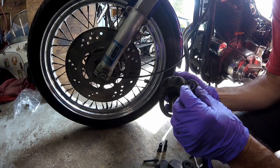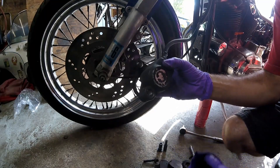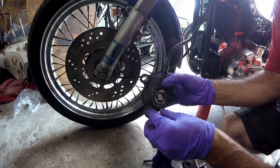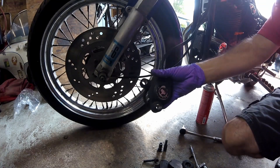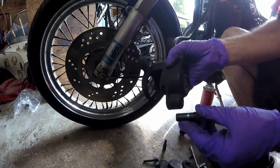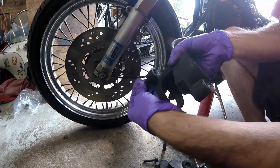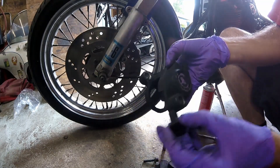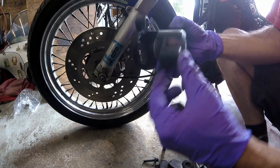There's a rubber o-ring here; I'll make sure to put a little lubricant on it. The other side is dirty too - clean it out. That's nice and clean now. Before I lube them, I'll make sure they slide free. They're free in the bore but the o-rings on both of them are tight, so we'll address that.